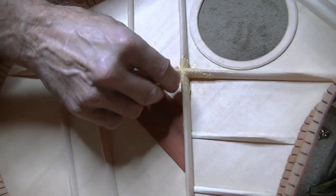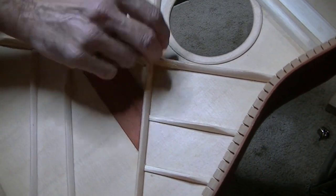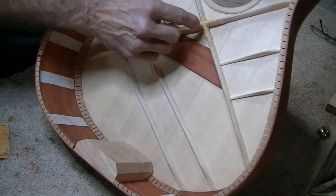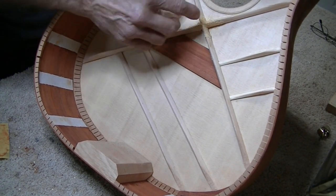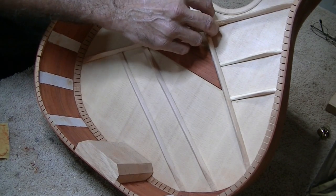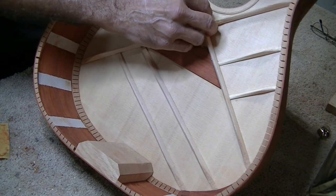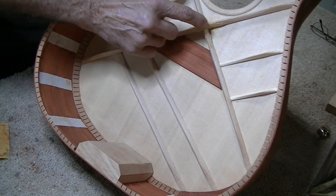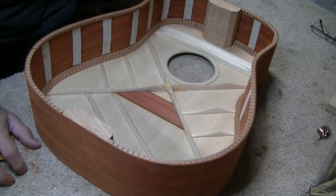You can see that we've got our bridge plate in there. We've got our reinforcement, and I just used a type of surgical gauze and soaked it down with glue, and that forms to this better. A lot of folks cut cloth a bunch of ways and put it on there, but when you cut it like that, you've lost a lot of the strength that you're going after. So I like the gauze method. It conforms to it better, and it gets really hard and really stiff. So that's a very stiff joint now. It works for me.